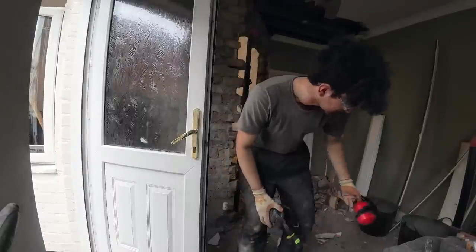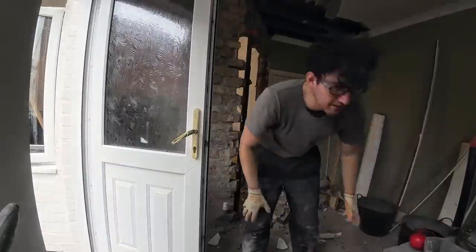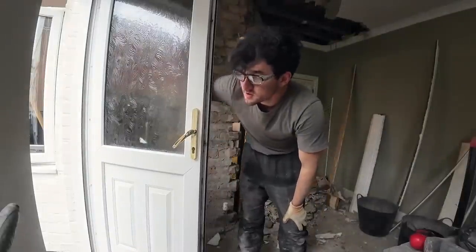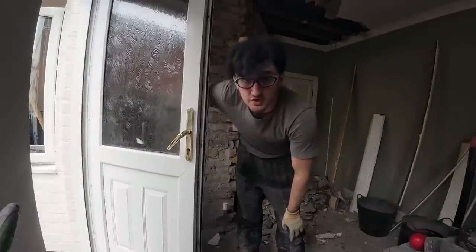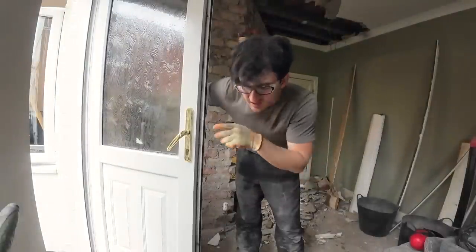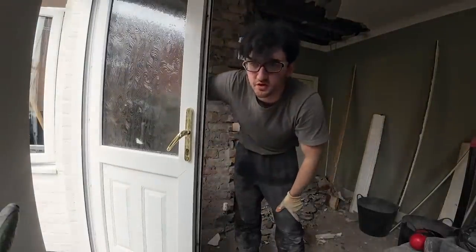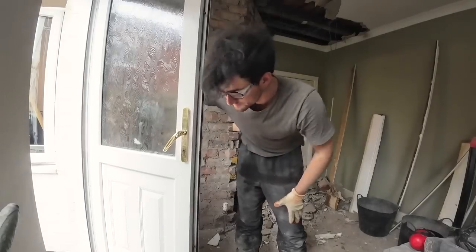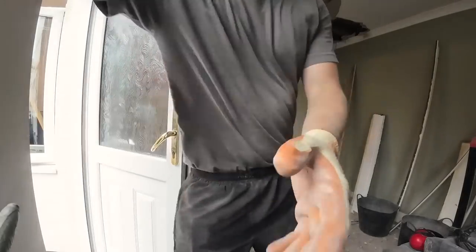Right, so I'll give you a quick update. We fell straight back into tradition, Dad's left me. But he's going to grab some sand cement and the Padstone so we can get that set today. Because since we're going to be drilling holes and all that into it later on, it's best if we get this set now. So it's got plenty of time to go off. But I'll stick you around here.